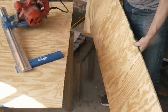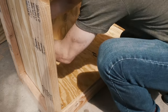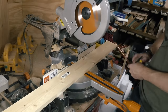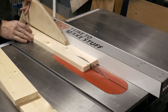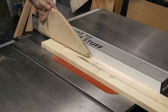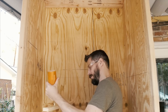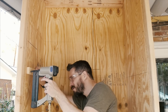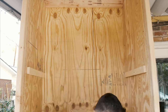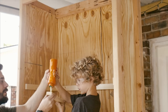Every panel that you add to this makes it stronger and more rigid. I cut down a couple more panels — one went on the bottom, and I just screwed this straight down through the top into the 2x4s below. Then I had to cut down some cleats out of some 1x4 material and these are going to hold the shelves in place. I could have done this outside but it's much easier with a miter saw and a table saw, so I came in to cut them down to length and then to width. I measured up on one side, made a mark, and then used a level to transfer that line all around to all three sides. I added some glue, lined these up with my marks, and then nailed them in place to dry. These aren't going to hold a ton of weight so I wasn't too worried about them being overly strong.